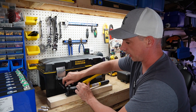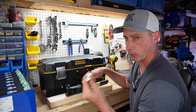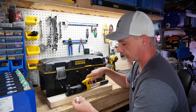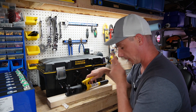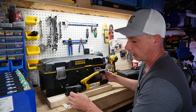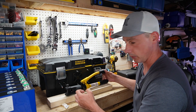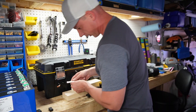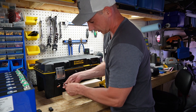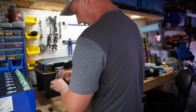This is a six gauge wire and a four gauge wire. The Anderson connector has four gauge lugs, so I'll be able to crimp down the six gauge and the four gauge. I'm going to start off with a two gauge crimp first and then switch to a four gauge for the final crimping. We have a bit of a jungled mess but this is perfect — it's not coming off. I'll put a bit of heat shrink there and then we're good.